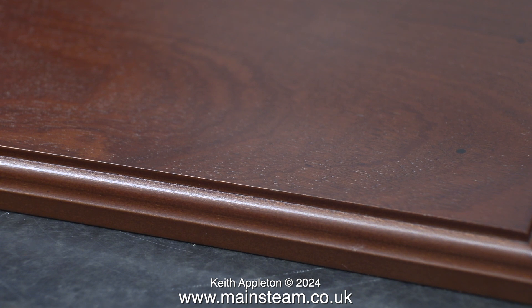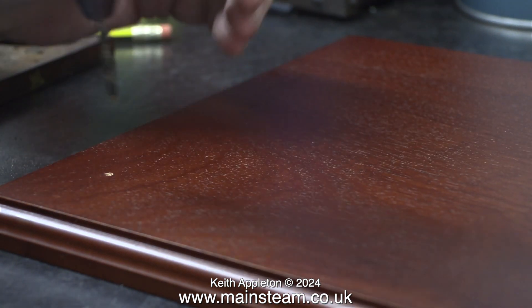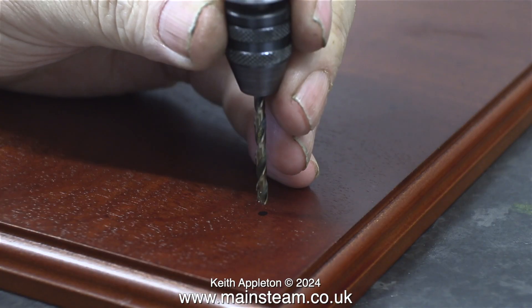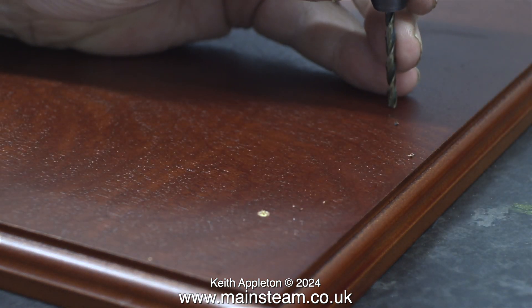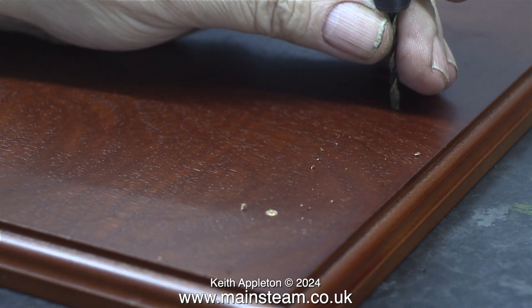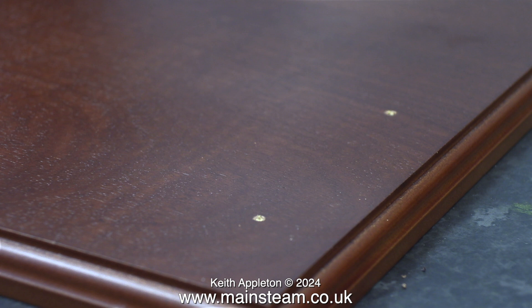I get comments about this so I'll pre-empt them. Once I've drilled the hole tapping size for 4BA, threaded the hole in the wood, and applied some superglue, it's surprisingly strong. Top tip: if you apply a spinning drill bit to a piece of wood or metal it's likely to slide all over the place, and on this nicely finished baseboard I really don't want that to happen. Instead, apply pressure with the drill bit onto the baseboard exactly where you want it and rotate the chuck by hand. This makes a deep mark in the top surface of the wood, which is a perfect guide for the twist drill. Sometimes I would use a centre punch, but I find this a better method. In no time at all the baseboard is ready for drilling.